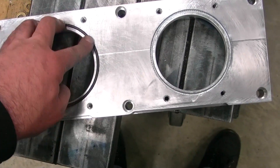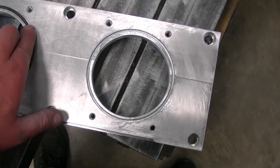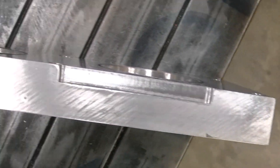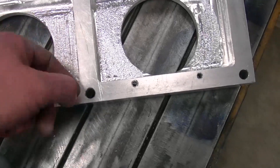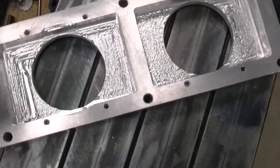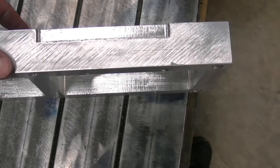Here's how far I got on that plate. You can see I got the o-ring sitting in there — I'm not going to cut it until it's ready to be finally mounted. I skimmed this off ten thousandths and now the gasket is just a little bit proud of the aluminum, so that should give me a good seal on my throttle body. There's where I notched for the throttle position sensors, and I went ahead and cleaned up the underside — took a carbide bit and lightly went over it to get the sharp edges off and radius all these edges, and smoothed the inside out. So this plate is now just ready for injectors — that's the next step on the build.